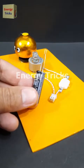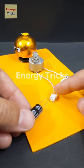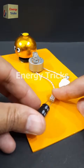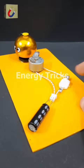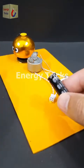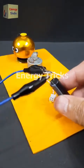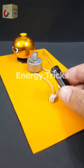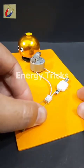This is a 2.7-volt, 10-farad supercapacitor. Today I'm going to use it to power this DIY bell — but will it work? First, let's test it without charging. Nothing happens, because the supercapacitor isn't charged yet. So let's charge it using a 3.7-volt battery — just a few seconds should be enough. Now the supercapacitor is fully charged, and I'll insert both pins into the cable connector of the DIY bell and turn on the switch.